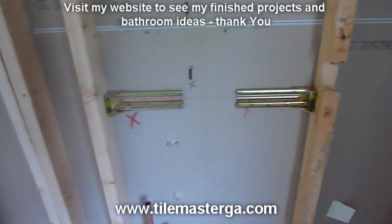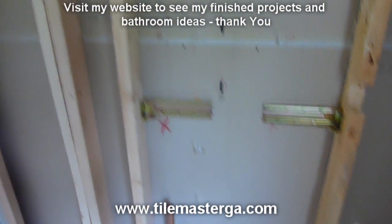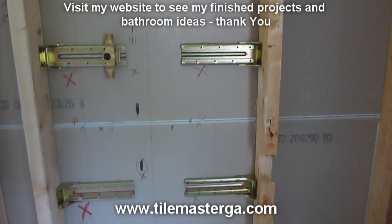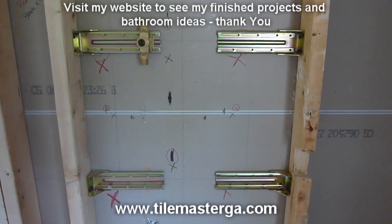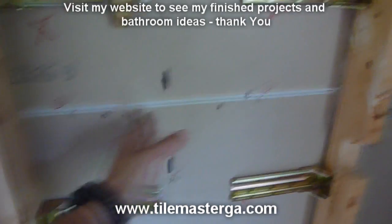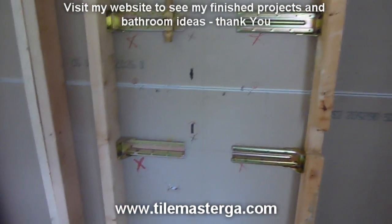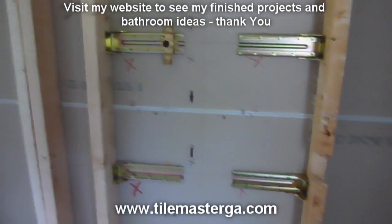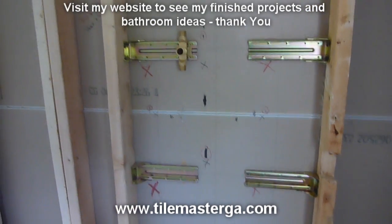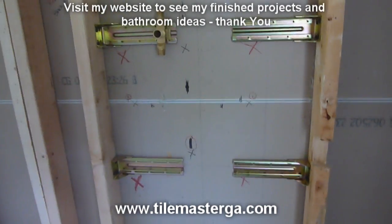Of course, I'm following all the instructions regarding depth — how deep in the wall everything is supposed to be. So when you do your installation, keep that in mind so there will be no problem later installing the final trim pieces and fixtures. Assuming nice planning and nice leveling, we have to figure out how the sprayers will line up, where the valves are going to be, where the volume valves will be, and of course have enough room to pack all of this into the space. Planning is a big part of the success in this case.